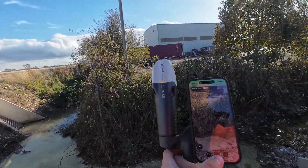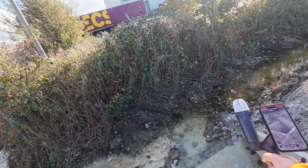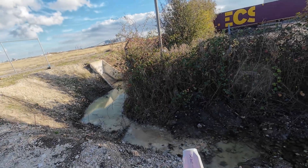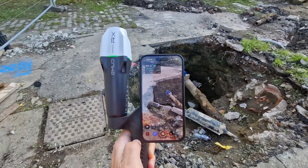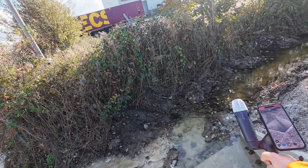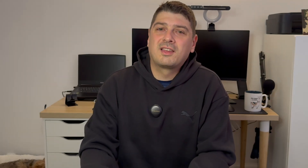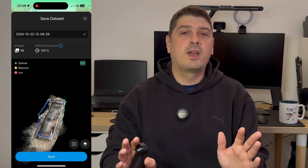The Pix4D Catch uses the iPhone's internal sensors — camera, IMU, and LiDAR — combined with RTK accuracy from the Emlid RX GNSS receiver to calculate data position. The Emlid kit handle has its own offsets already introduced in the software, so you don't need to worry about that. When scanning, Pix4D Catch takes still images from your video, so it's important not to move fast to avoid motion blur. Even if you lose the RTK signal, the software stitches your images to the RTK-fixed data, so you shouldn't lose too much accuracy. You also have the option to use targets that come in the kit box, which are automatically recognised by the software after you survey them. At the end of the scan you get a low-resolution preview and scan quality report straight on your iPhone screen.